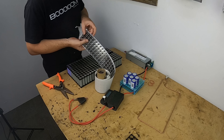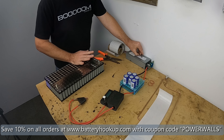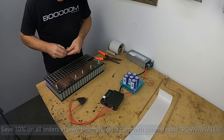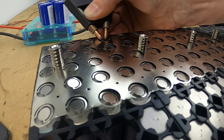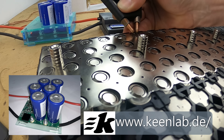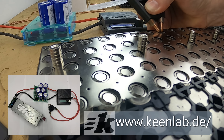The parallel connection to the 18650 cells is completed with 5P fused nickel strip supplied by Battery Hookup. The spot welding duties have been taken care of by a K-Weld spot welder powered by a K-Cap and a K-Supply attached to an HP server power supply.